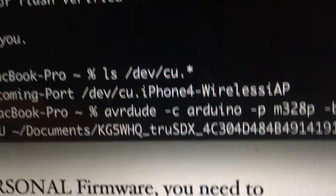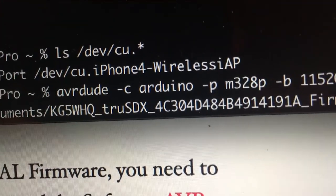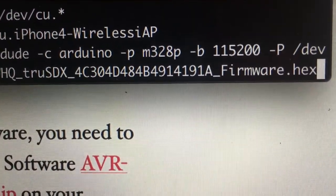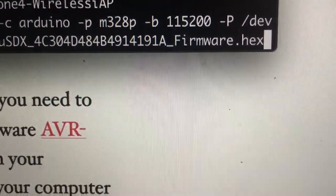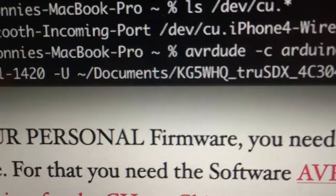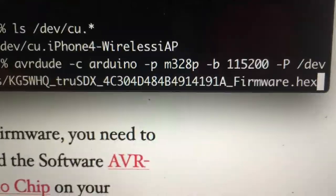The command line — I'll speak this so you can write it down when you need to. The avrdude command is: avrdude -c arduino -p m328p -b 115200 -P /dev/cu.usbserial-1420 -U followed by the location of the firmware wherever you put it. Don't bother trying to get mine — it won't work for you; it's signed in accordance with the hardware. I will put more documentation in the description or on the club's website.